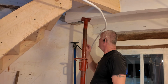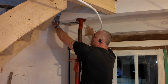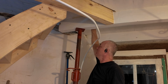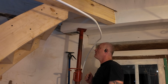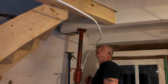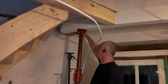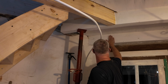So I just got a piece of beam to size to fit here. I want to have a piece of beam sitting here. Why? Because at the moment the floor, my ceiling, but the floor is on one side resting in a rebate in the wall. I don't like that. I think that's just not smart. I would rather have a beam sitting here, properly fastened in the wall, and then the ceiling, the floor, resting on that. Just like it's on this side.